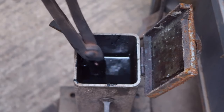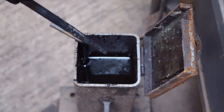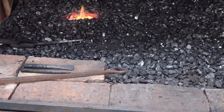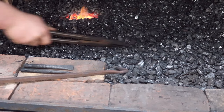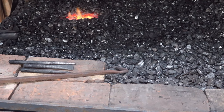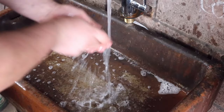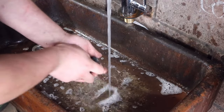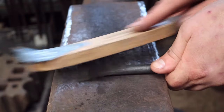After your steel has been in the oil for about a minute, take it out. Remember, this metal is currently hardened but not tempered yet, and it's going to be very brittle, so don't be too rough with it. Give it a rub around in some dirt — this isn't anything to do with the heat treatment, but you'll find it is a little easier to clean, and you'll end up with less gunk and oil whenever you clean them up. Quick warning: when you're checking to make sure the metal is cooled, be extra careful — you want it to be fully cooled. The oil on the surface can still be incredibly hot, and it tends to stick to you a little bit more aggressively than the hot steel. When it's all cooled, head over to the sink and give it a scrub with some soap and a scouring pad. This will help you see the tempering colours in the next stage. You may also want to wash your hands to reduce any chance of getting leftover oil on your work. Give it a good old scrub with a wire brush or even some sandpaper to reveal the steel to the air — make it nice and shiny.